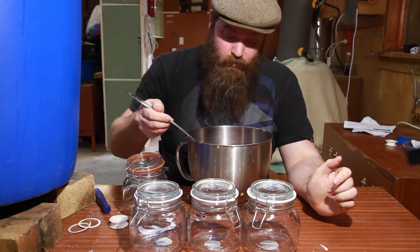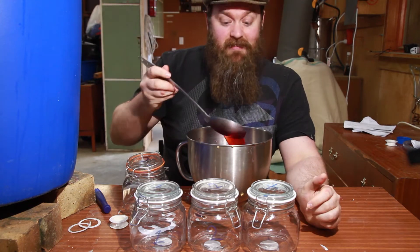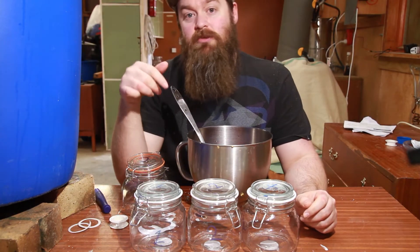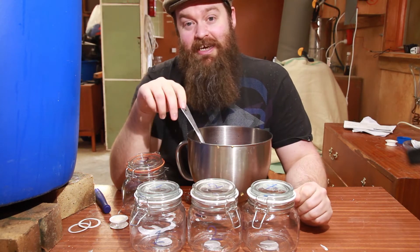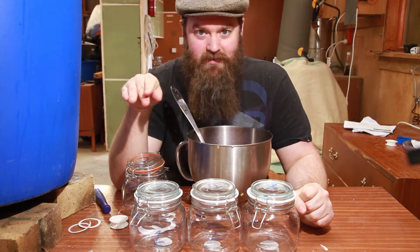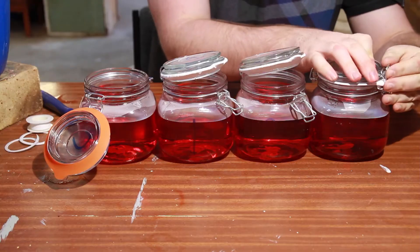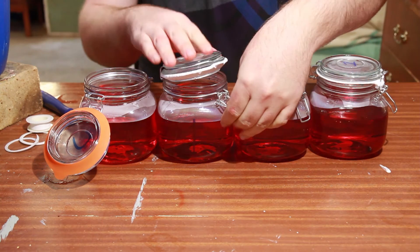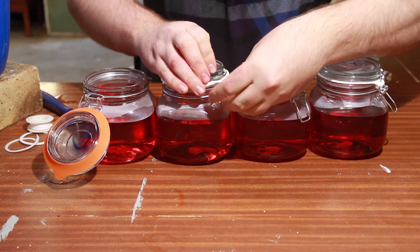I have the three wrapped gasket jars ready to go — numbered on the top, front and bottom so there's no chance of mixing them up. That's the single wrap, double wrap, and the one wrapped four times. I also have around four litres of water with red food colouring in it. The reason for the food colouring is that when I open these up and cut the gaskets out, I want to let them dry first so I can tell if the paper got wet at some point.